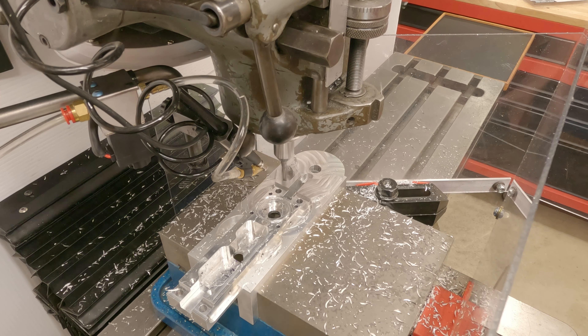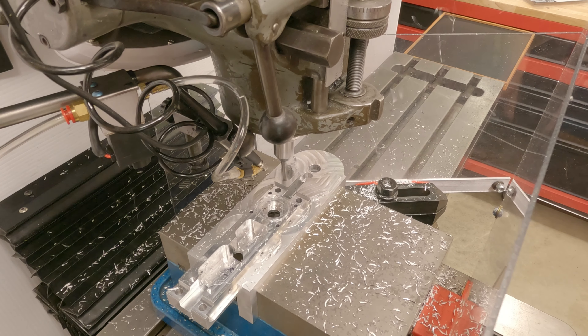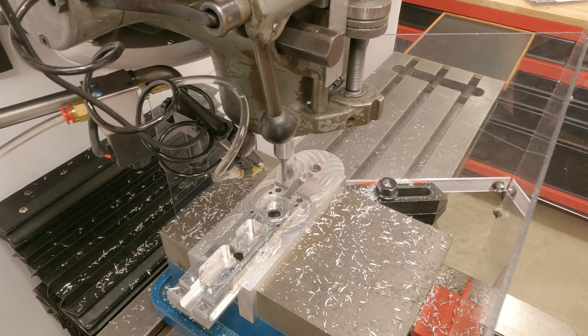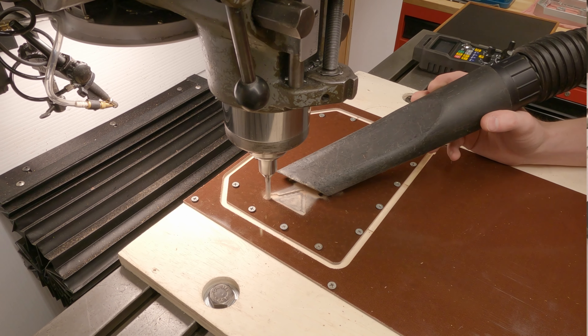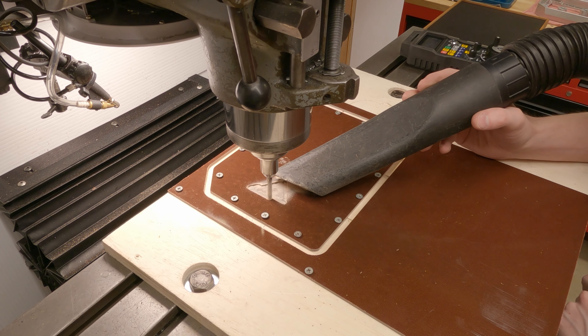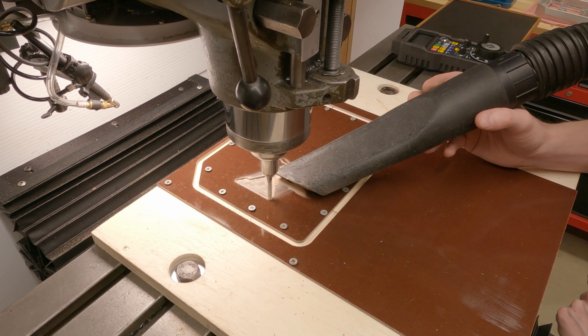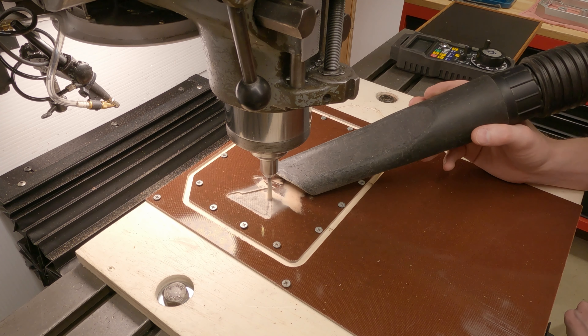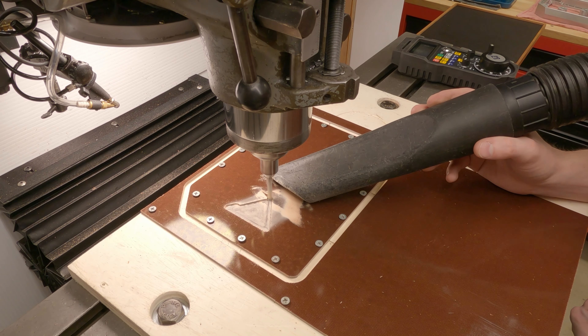In order to accommodate this massive addition of weight, we've reduced the weight of each side frame by 0.2 pounds and the drum internals by 0.6 pounds. We've also cut weight in the covers by switching from 6061 T6 aluminum over to Garolite, which is a fiberglass and epoxy composite cured at high pressure. Since the aluminum covers didn't hold up very well to vertical attacks anyways, we're not losing much armor by switching to Garolite.